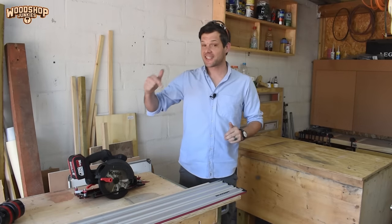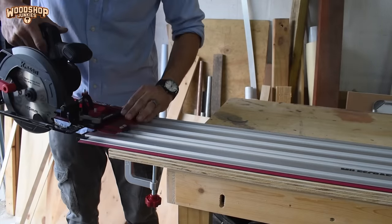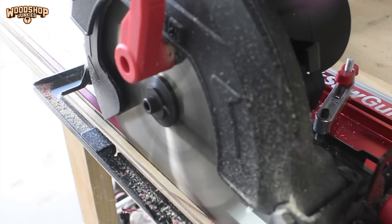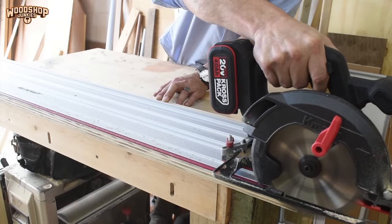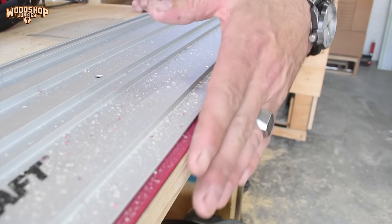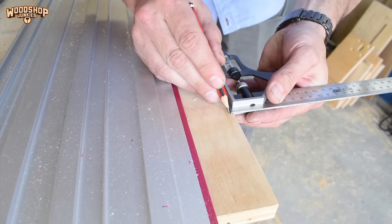The first cut is to calibrate the guide strip, so I need to run the saw along the entire length of the track, feeding it in at the start and out at the end. If I ever change saws or change the blade I'll probably have to replace and recalibrate the cut guide. Now the cut guide is calibrated — trimmed to sit exactly where the saw blade runs. For future cuts I mark my panel, align the cut guide with the marked line before clamping down, and the saw traces the cut line.